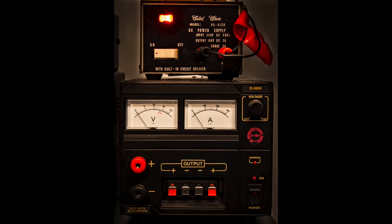Here are two more power supplies in the shack. The solid state power supply at the top is a rebuild — I managed to blow it up many years ago and we rebuilt the supply, so it's giving out about two and a half amps at 13.8 volts and it works very reliably and very quietly. The one below is another big variable power supply that goes from 3 to 15 volts and up to around 25 or 30 amps. The only problem with that big supply is it's got a very noisy fan on it, so I don't like using it unless I really have to.